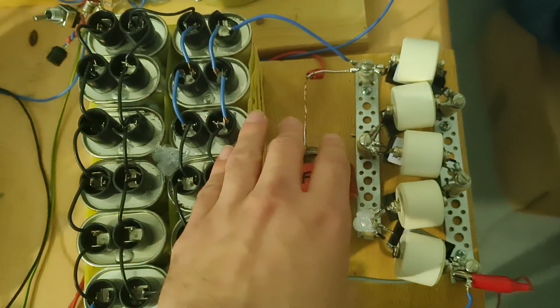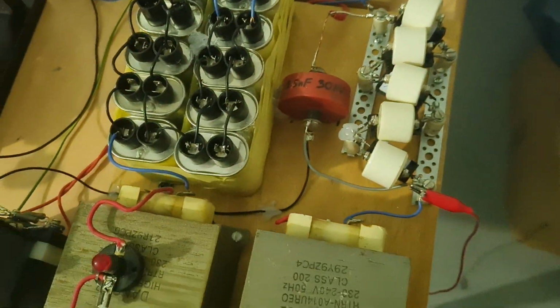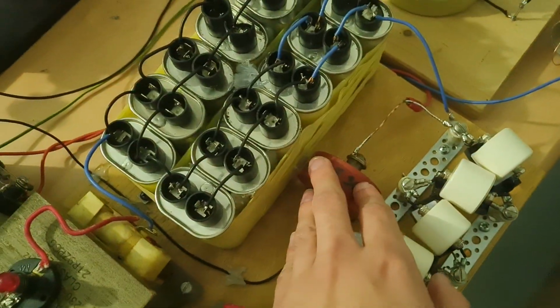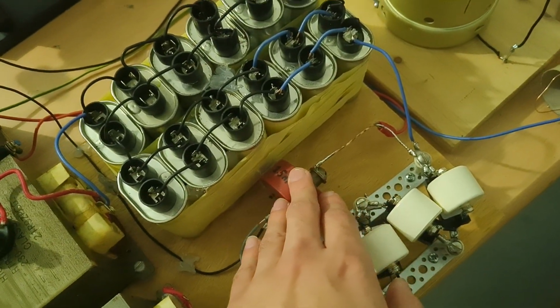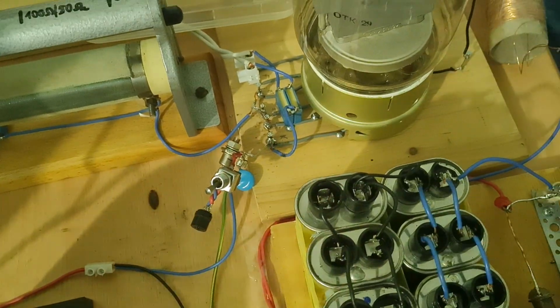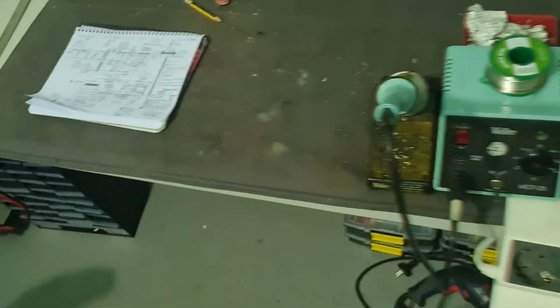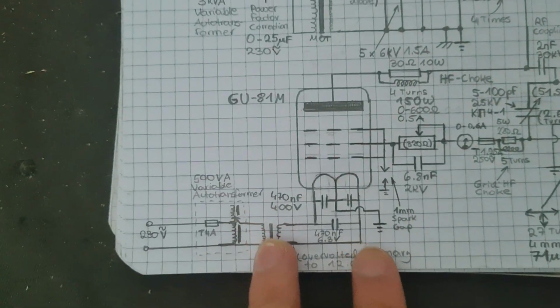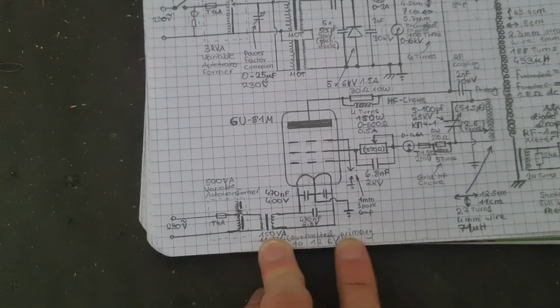You want this to short the RF, and you don't want a longer connection to the diodes, because the capacitor might be far enough away that the RF passes through the diodes and not through the capacitor. The filament RF bypass is also needed. I have a dual bypass system from the filament ends to the center and across the filament ends. That's the best way of doing it.